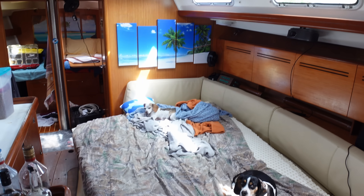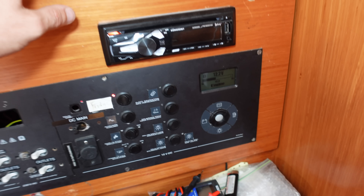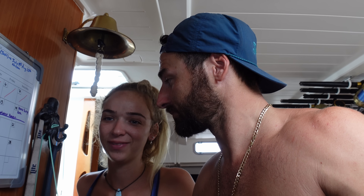We are working on the DC side of things now — actually, the switch panels. We've got a DC switch panel and an AC switch panel, and right now they are all messed up — original old stuff. This circuit board is bad: even when I turn the fridge off, the light stays on and we're drawing bad amperage. So we're replacing all of this, rewiring the entire boat. Nothing works — the VHF, the radio, any of the old instruments. We're replacing all of that, and converting it from 220 to 110 and putting in new outlets.